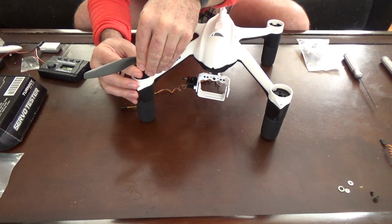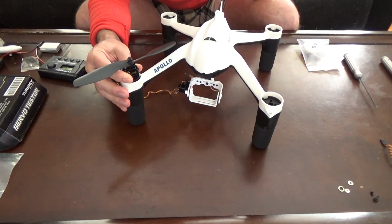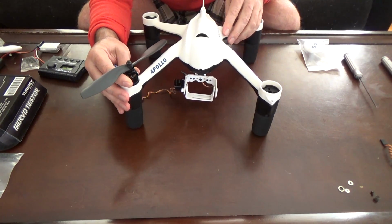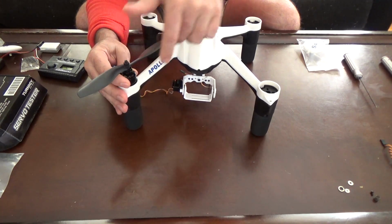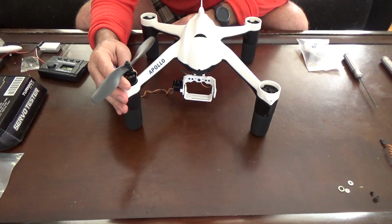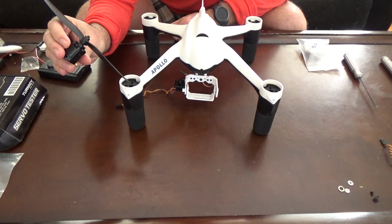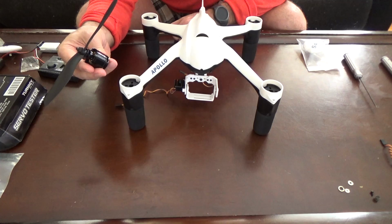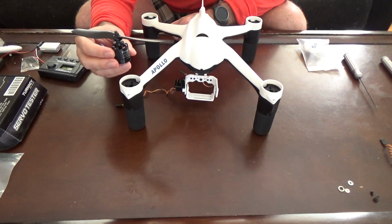This will increase your height, especially for the 2208, which is shorter. And then you have the right height. And the 8 inches, it clears everything. It's good enough for the airflow to go through, and it's a lot more efficient. So this is my suggestion. This right here is an APC 8 by 4.5 prop. So you can grab the Sunny Sky 2208s for this.